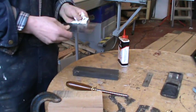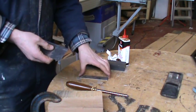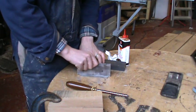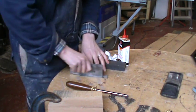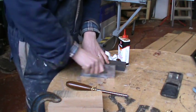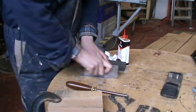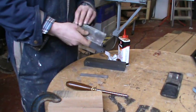Clean off the oil and then what we are going to do is create a fresh burr onto the scraper. So I am using this — it worked really well. I just hold the scraper at 90 degrees and the rough side goes a little bit faster and it gives a good enough edge. And we have got to do this quite a few times until you build up above one edge. It's not too bad — a little bit more.